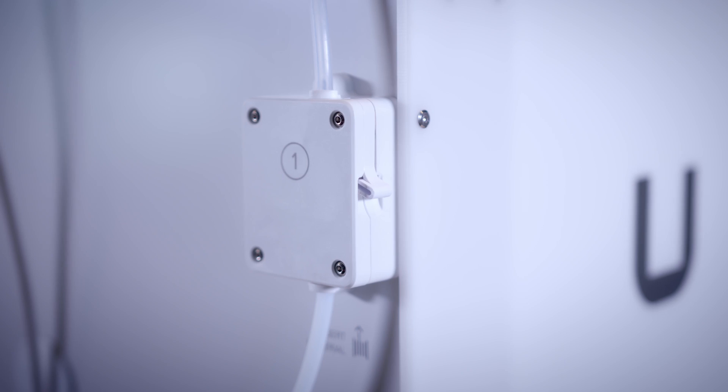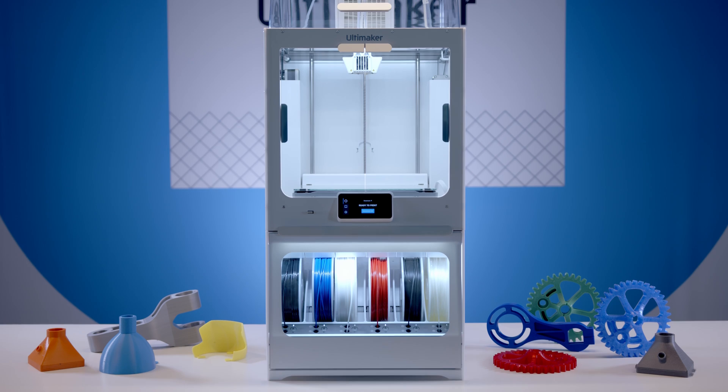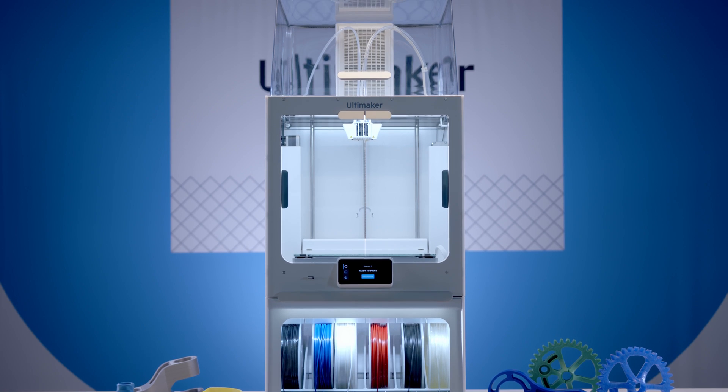Having a badly cut tip can result in blockage and errors. The Ultimaker S5 has a flow sensor in the printer's feeders. From firmware 6.5, the material station will use these flow sensors to detect more accurately where the material is during the loading procedure. This will increase reliability and efficiency, highly decreasing the chance of grinding and error 65.